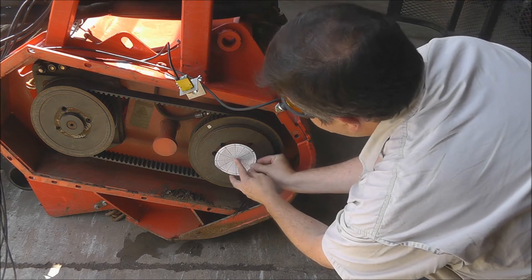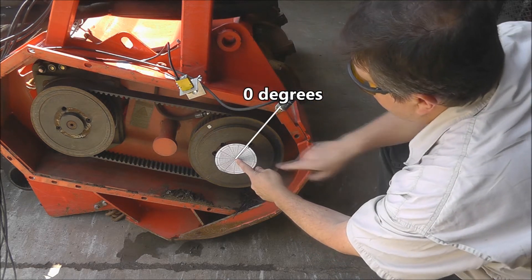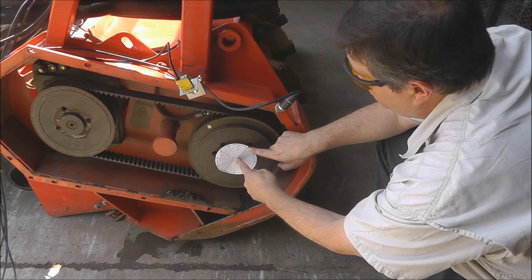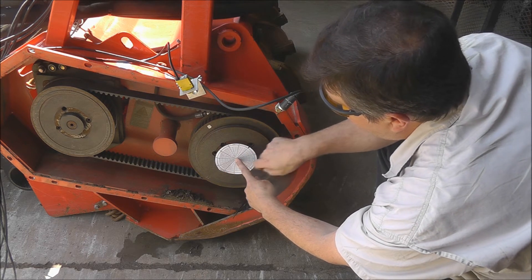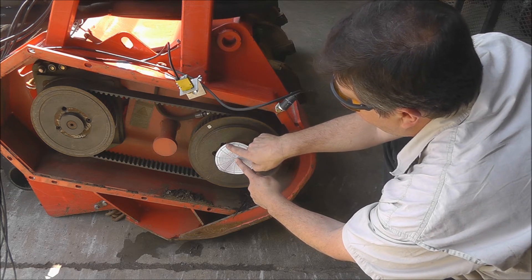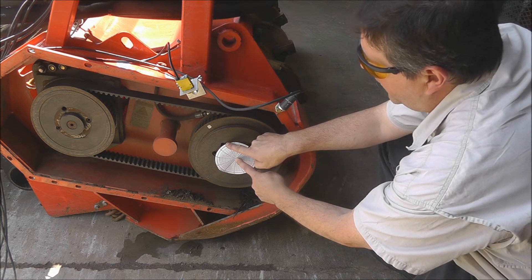Hold the guide up to the center and turn to zero. Moving in the direction of rotation of the rotor, we're going to find 303 degrees. So we've got 90, 180, 270 — and right around here it's 300 degrees. So 303 degrees will be right here.